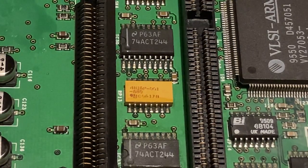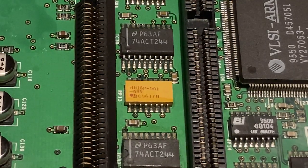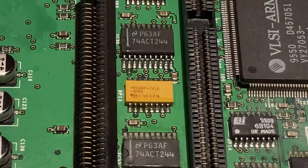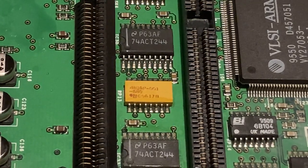And I should explain that the vias, although they are originally holes, they're actually filled with this green paint. It's like a solder resist paint that's sprayed onto the board. That fills up the holes so they become effectively blocked. And then when the battery leaks, all the alkaline and the corrosion products gather in the hole, so you get a hole full of this horrible debris basically.